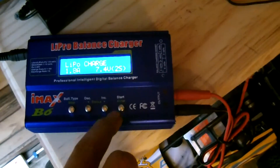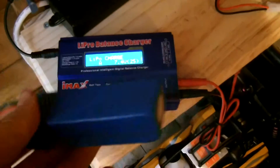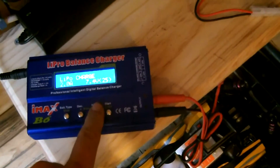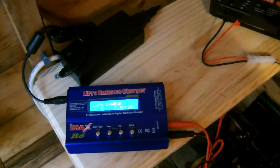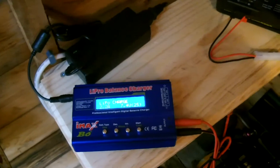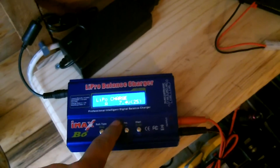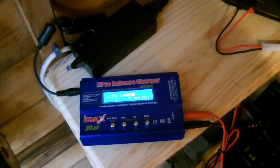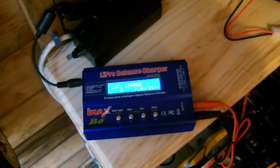If we are using a 2200mAh battery, you enter 2.2. Likewise, if you're using a 1800mAh battery, you do 1.8. Basically you're taking the first two numbers and putting a point in the middle of them, and that will guide you on how to charge up your amps.